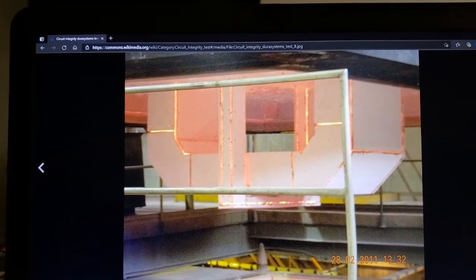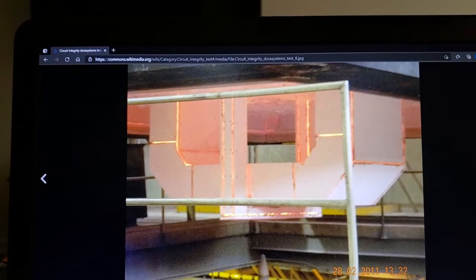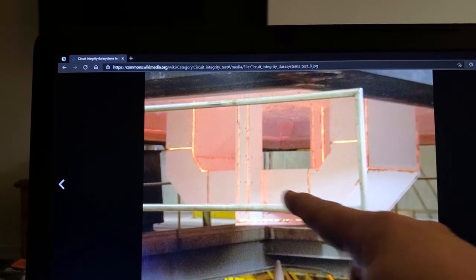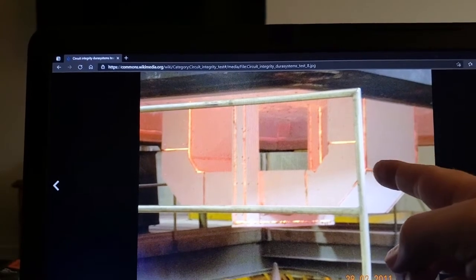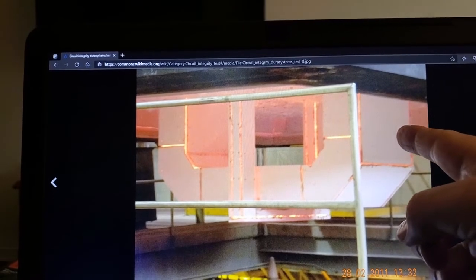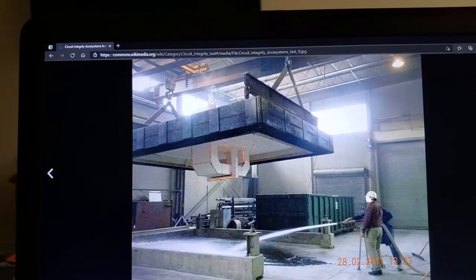And it should be the same way for pressurization ductwork, because if the fan is toast, the fan oftentimes sits on the inside of the ductwork in a building, inside of a fire compartment, which could be engaged in fire. You want to be able to safeguard that. And in fact, this was tested without any wires in it. Why? Because wires actually make it safer to pass. Why? Because you've got an additional heat sink. Even if you energize those cables, that's just a whole lot of mass that can absorb heat away. So in this case, this was tested empty. We're just seeing what heat comes through.